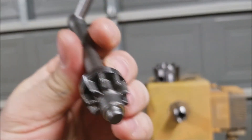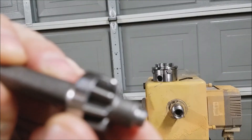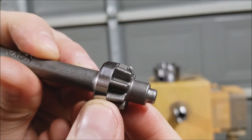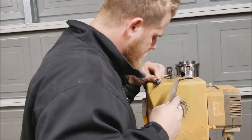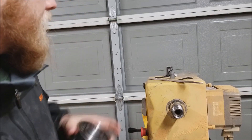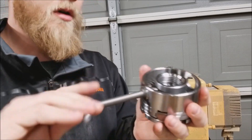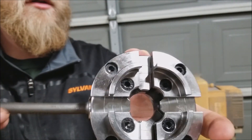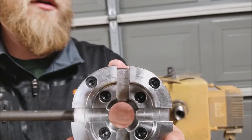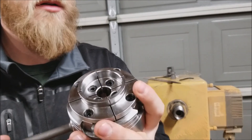This is brand new, but just so you can see — there's a piece of metal sticking out on the gear. Every time I turn one turn, it catches. So I'm going to file that off. It's actually helping a lot — not 100% yet. So that's fixed. It opens and closes like it should. There's the fully open position — that should be 50 millimeters across the front. As you twist this, the jaws retract and clamp on to the wood.